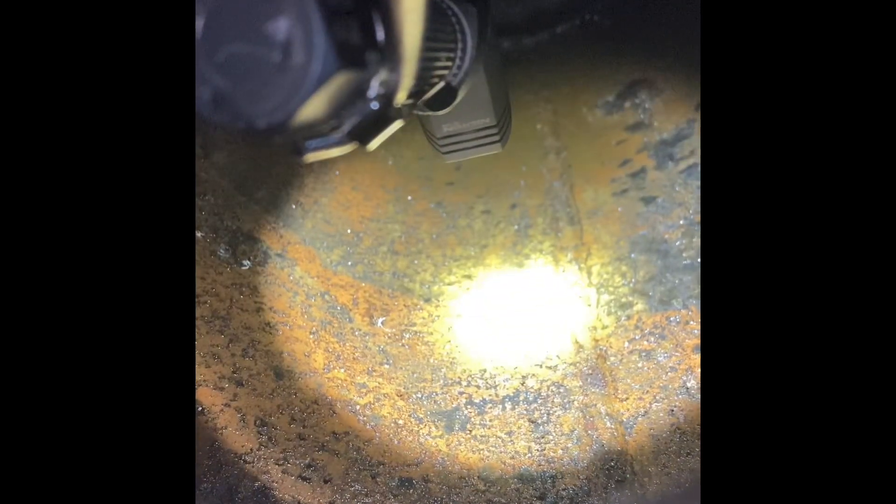Here's that piece of pipe as removed from the tank — that's why you really want to get your anode and cathode set up properly; look what it's done to that pipe. Just a quick reminder: this is what we started with inside the tank, and here it is cleaned. It did a better job towards the top of the tank than the bottom. The grey on the right-hand side is actually bare metal, and you can see the top lid is almost all bare metal. If I wanted a better job I would have refilled it and put the electrode in from the other end, but I'm quite happy with it.